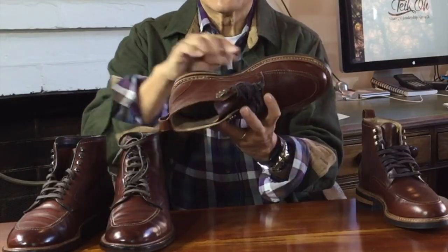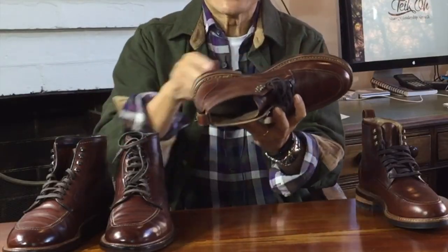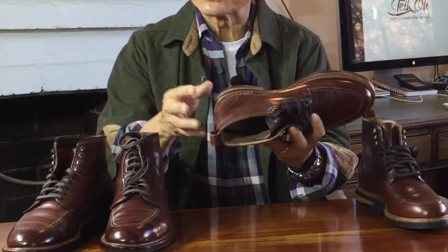They have different outsoles, but both are connected to the uppers with a Goodyear welt form of construction. That's where a thin strip of leather called the welt goes around the circumference of the shoe — the uppers are sewn to the inside edge, and then the outside edge of the welt is sewn to the mid and outsoles. Goodyear welted shoes are made either with a 360-degree or a 270-degree form. In the Rhodes Owen, the welt goes all the way around the boot — hence 360 degrees, or full circle.